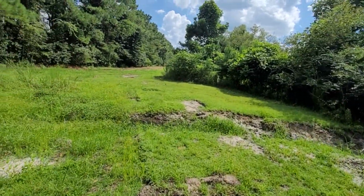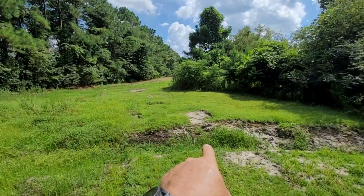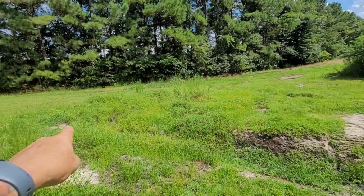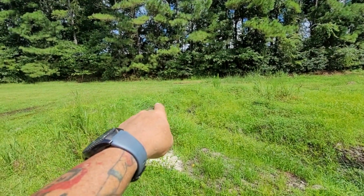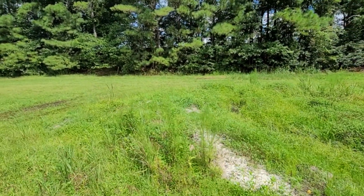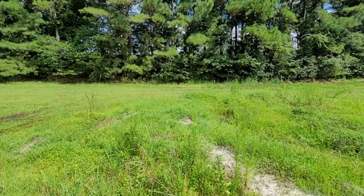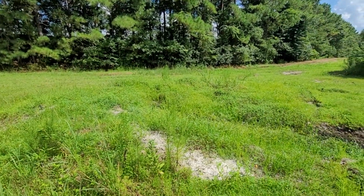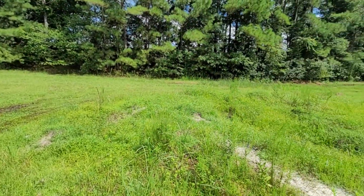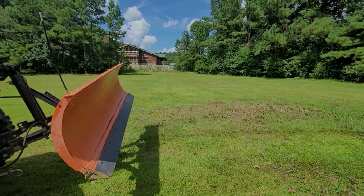And then when I dig this, I can take that dirt and put it back over the pipe. So I'm going to put the pipe in, have the stub just sticking up over there. When I put in the drain, this way when I concrete it and put the anti-seep collar and all that around it, it will be good to go, and I can drive right across. I can't even bring the mower over here. I did the other day, but I came around and it's a little tough. All right, that's what I'm going to do tomorrow.